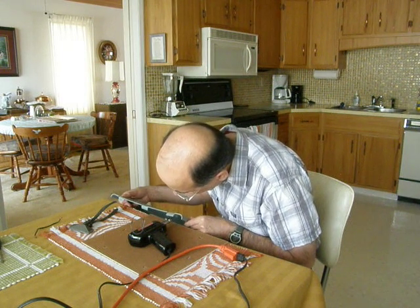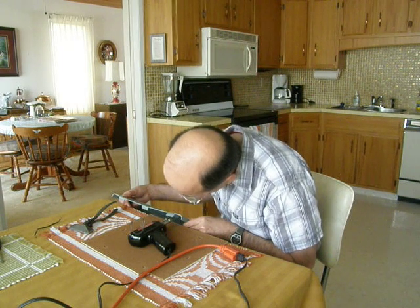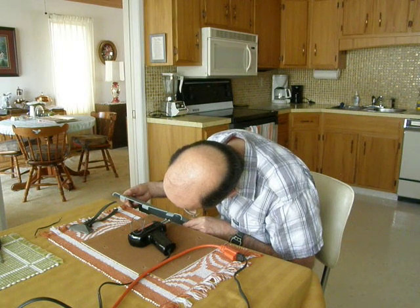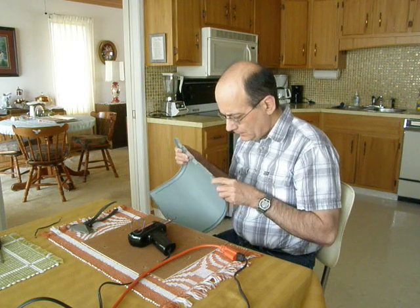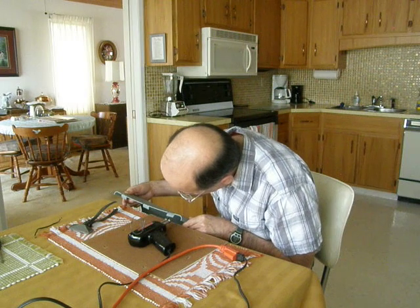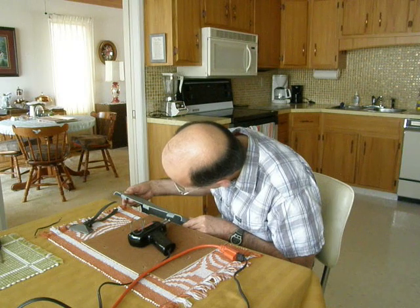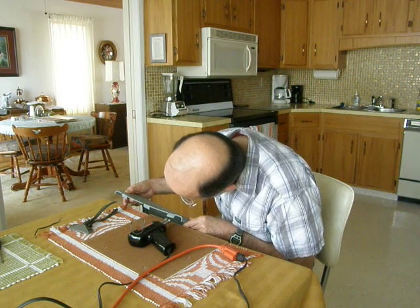Just a little bit more — getting close. It would be nice if the heat output was just a little bit higher, but at least it'll get the job done. If you try bending it when the material is not quite hot enough, you end up cracking or breaking the material, and then you've got a weak bend. So I'm trying to take my time.